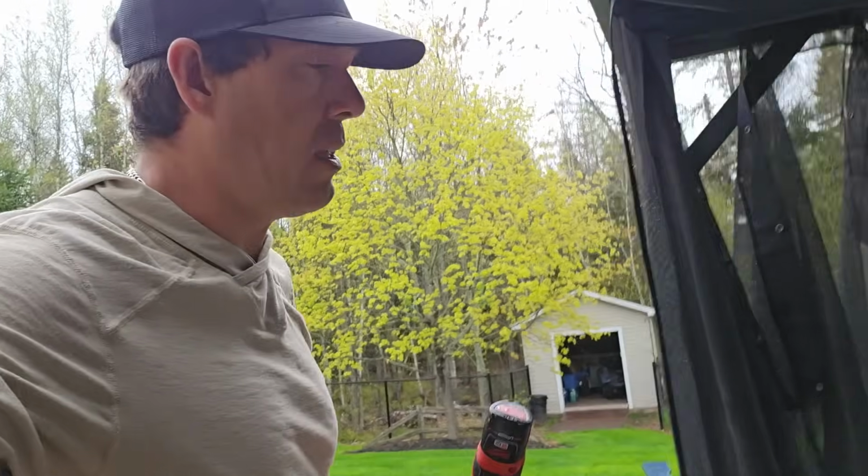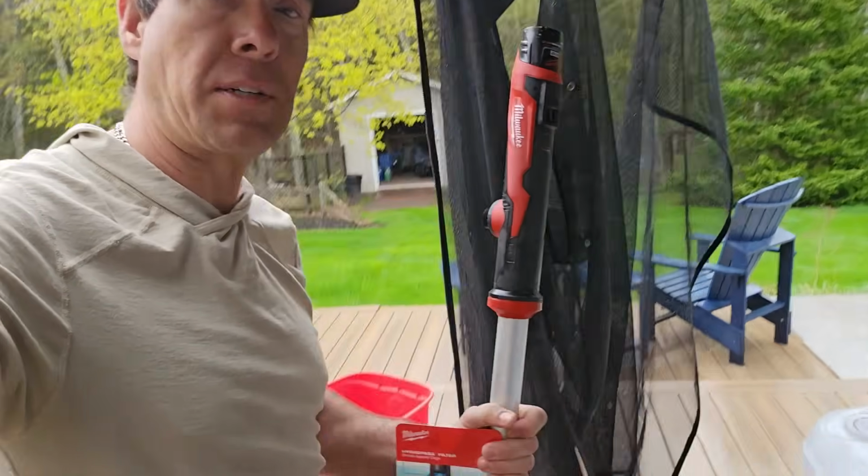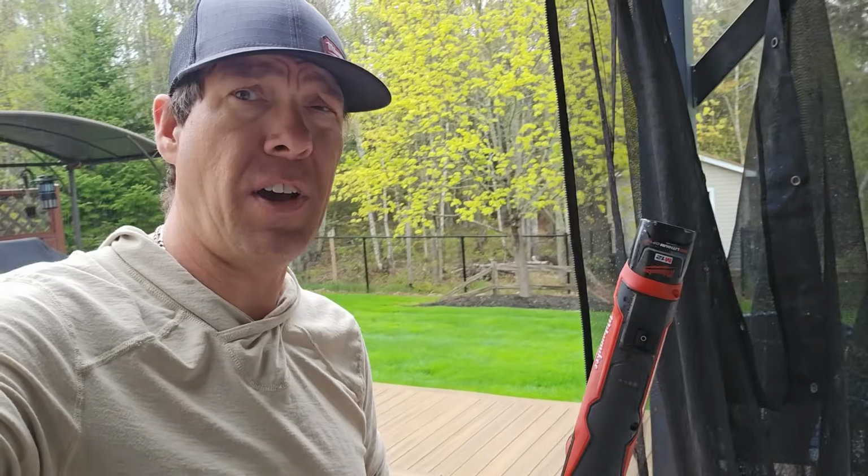I think with the low voltage residential URD boxes, I'll stick with the stick pump. A little bit more practical than lugging that big fella around, although it works much faster. But when we get into the bigger stuff, underground vaults or the large pits, that guy is going to be a great addition to our toolkit.